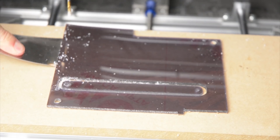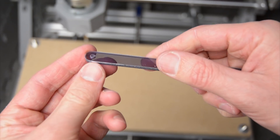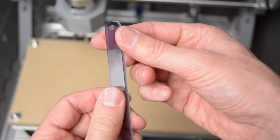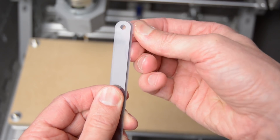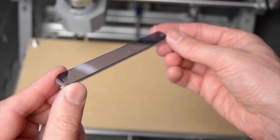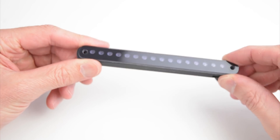Once complete, the bolts are removed and the part is lifted off the double-sided tape. The depth of the final pass could have been set slightly deeper, as there was a little bit of plastic left on one side to clean up. For the first attempt with Perspex on this machine, the part cut out well and fitted onto the 3D printed case as designed.